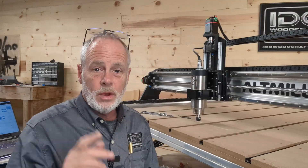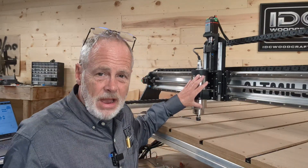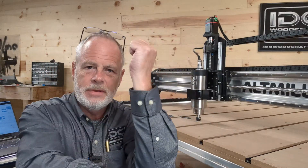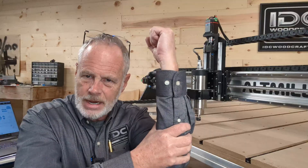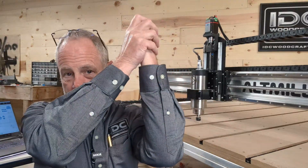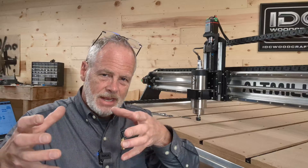Roy, there is one other thing to take into account when getting your spindle set properly, and that is the balance of the spindle. Spindles on CNC routers have a fair amount of mass, and if your spindle is mounted on the bracket where the bulk of the spindle is above the bracket, or especially if the bracket is here and your spindle is hanging way down, that can actually be detrimental to the quality of the cuts you're going to get. You're hanging all that mass out from the bracket either above or below, and as it's making its cuts, the spindle can actually vibrate a little bit and make those cuts look a little choppy.